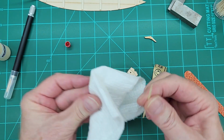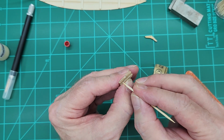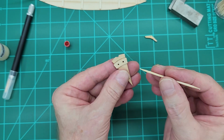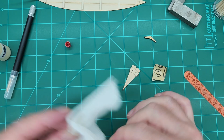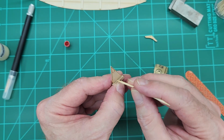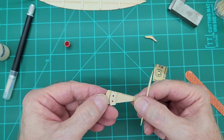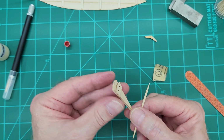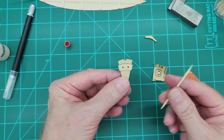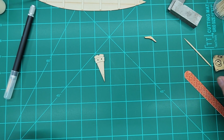And we're just going to go ahead and remove a little bit of squeeze out that we got going on there. We don't have to deal with that later. Once this yellow glue dries, it becomes extremely hard. So that is probably going to be our biggest issue, making sure that we've done cleanup correctly. Now you can use isopropyl alcohol, or better known as rubbing alcohol, to dissolve it and clean up, or soften it so that you can clean it up. And I imagine we're probably going to run into that. Since this boat's going to be built upside down, that's going to create an issue for us later on.